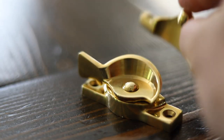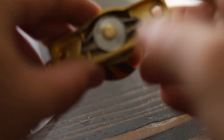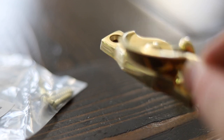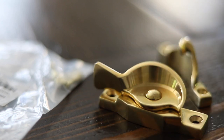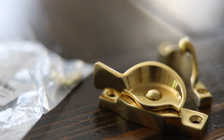The package includes the lock, the keep, and slotted screws. This lock comes from SRS, which is a niche online window hardware supply. This lock is large and heavy — it's two and seven eighths inches wide, and you can really feel the difference in build quality. When installed, you can see this lock literally from the street. The large lever makes it really awesome to pull windows closed and reduce air infiltration. I do really like the positive stop feature — it's really cool how you hear that pop. The lock is solid brass, meaning as the finish tarnishes over time, it can be polished and restored. So that means you're making a legacy improvement in your home with a lock like this.